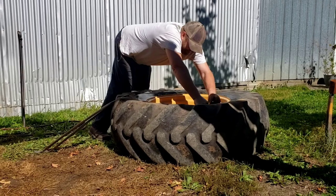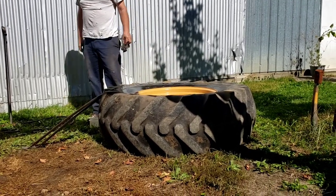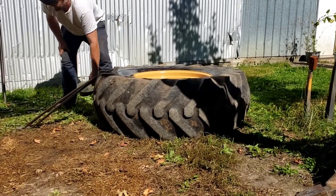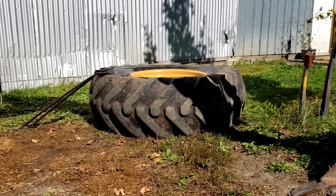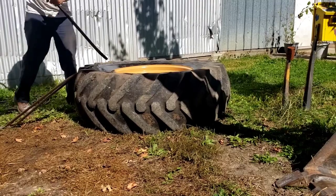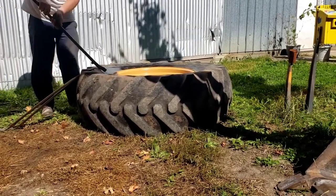So first he started with blowing air into the rim where it all meets to make sure that none of the backhoe dirt was in there. Soapy water makes it slip. We just use our Dawn dish soap from the house with a little container of water. He keeps that around all the time, sometimes spray bottles, but the rags are a lot faster.